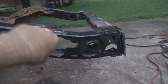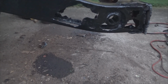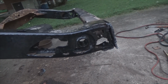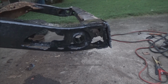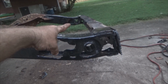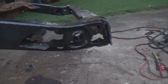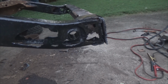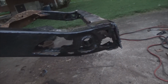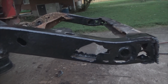You see, I've got the paint on that one. This was painted, prepped up, ready to grind off the paint to weld in the plates. Now, some of you are going to notice where I cut this off. If you're doing a stock rig, if you're just patching metal, you do not have to cut those off. This whole back piece is going to be gone for me because I'm doing the stretch, remember? I did it because I was prepping for my modifications. I know I keep repeating myself, but I don't want someone saying, I cut it off and I shouldn't have. Well, don't cut that off.